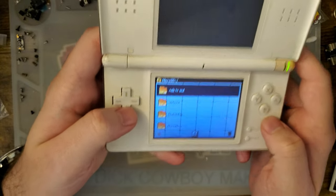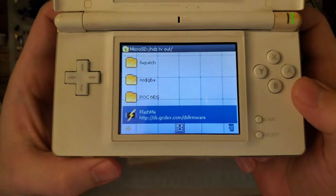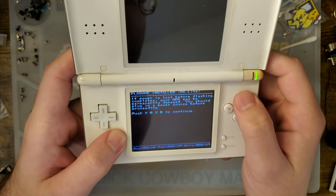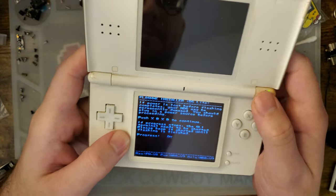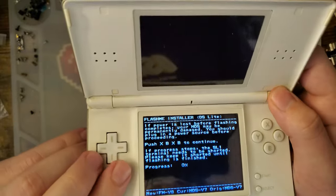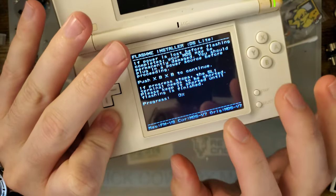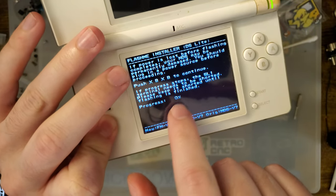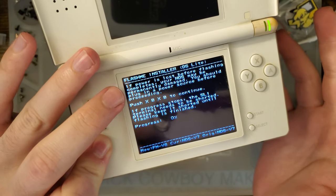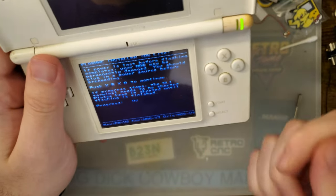I'll go into my SD card and into the NDS TV Out folder. We'll start with FlashMe. The top screen is still messed up but that's fine — we won't need it. To start, we need to press XBXB. And then it'll automatically start flashing, but you'll notice the progress is hung at zero because we need to short out SL1. It's going to be difficult to show both the screen and the process of shorting it out, so I'll just walk you through that. Once you have that pad shorted out, this will walk right through — it's pretty quick, only about 256 kilobytes.